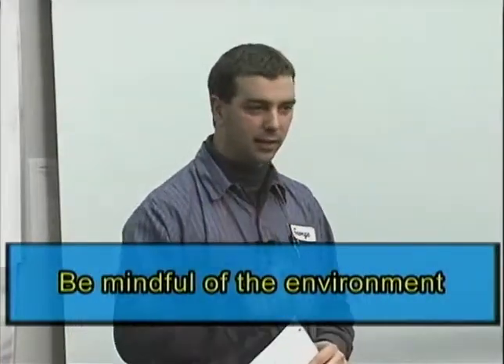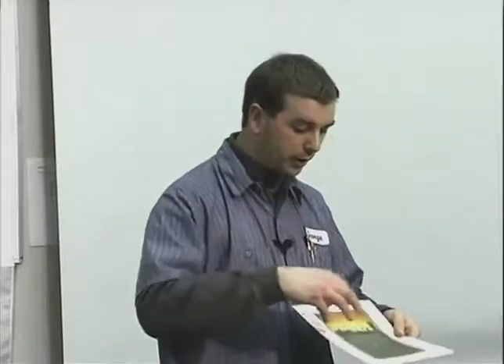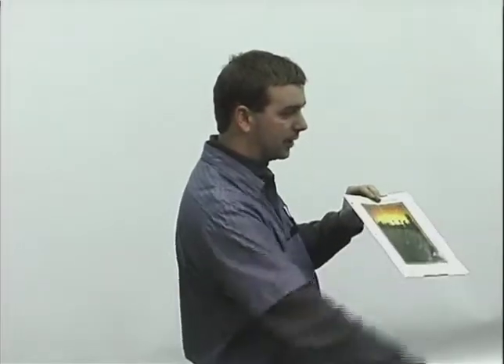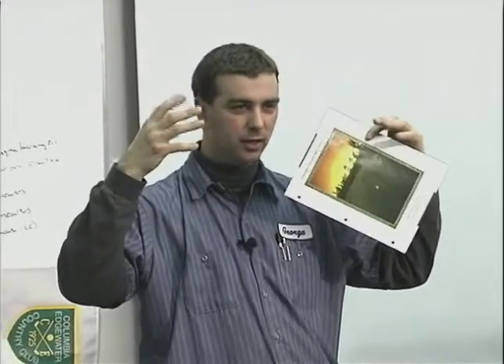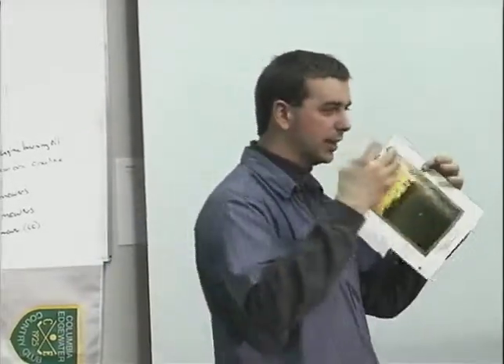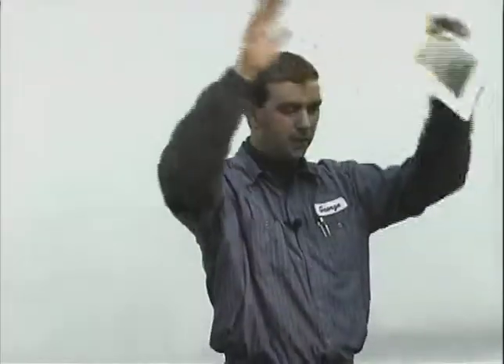I've had salespeople come and give presentations. One guy from Mountain Oil took the grease that we used, put it on a tin pan, took his grease, put it next to it, and put a fire under it. Pretty soon the grease that we used melted and ran off — he said, 'See?' But you've got to think about it: if a grease is in a bearing traveling at high speeds and it flies out, the bearing runs dry and gets hot. If it gets hot and melts the grease a little bit, the grease will run back into the bearing. If I have a grease that doesn't turn a little bit fluid when it gets hot, it'll stay out there and my bearing will continue to run dry even though it's caked in grease. So that may not necessarily be a good thing.